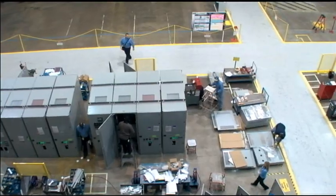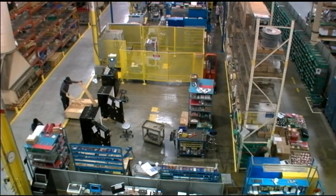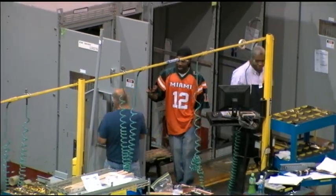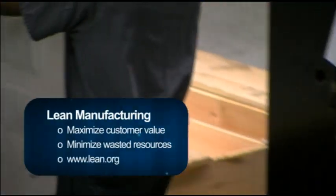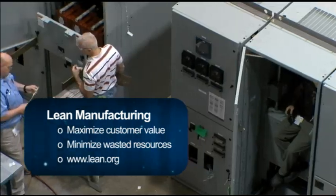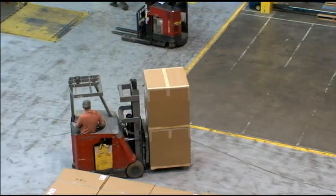We have sub-assembly departments that entail producing bottles, pans, drawers, pre-paneled wires, and doors. The idea is to have all of our sub-assemblies, our steel and copper components ready, so when we get into our lean assembly process, we can start pulling these components in as needed and build through our lean operation up into final assembly, testing, and on to shipping.